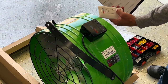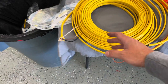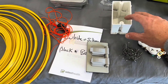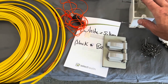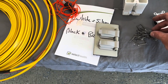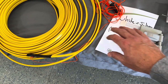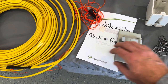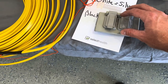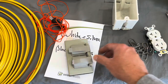The switch turned it on. I'm ready to get up in the attic to install my outlet box. I have my outlet box, my 20-amp outlet, some NM staples to staple this to the rafters and joists — so it's not going to be a tripping hazard. And then I have an outlet cover — this is like an outdoor dust outlet cover for damp locations. I'm going to install that over the outlet when I'm up there.